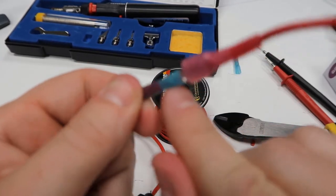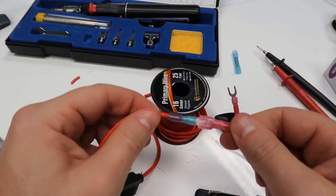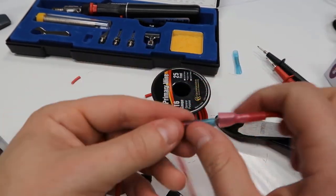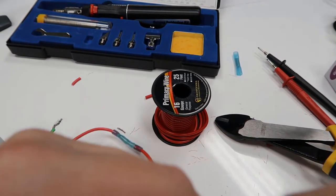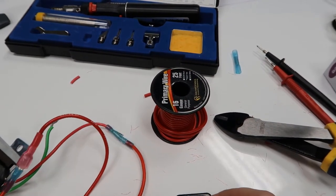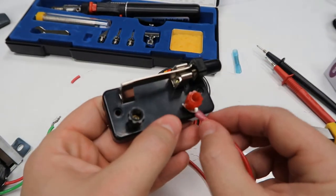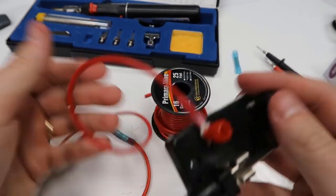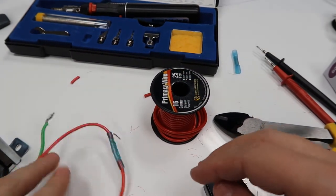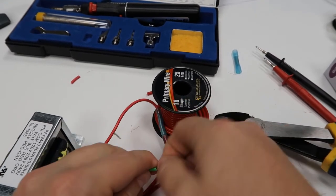And you can see here we've got some gap. I'm only making it this way because it's a 24-volt connection that I'm using for a demonstration. I wouldn't leave this bare like this. Normally, I would just make an actual butt connection, but I'm just doing this so that we have a quick connect in and out. But now I'm going to connect this to here into the switch. And then we can go out of the switch to our relay so we can control our relay coil. Now the only final thing I want to do is I've got this little short bare wire, and I'm also going to make some butt connections to the cord.